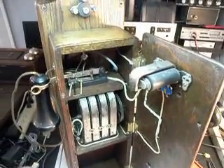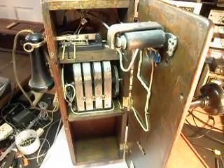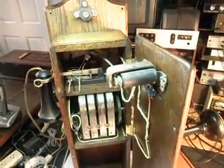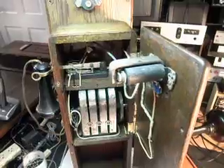They had a request that basically they wanted the telephone to ring, but they also wanted to be able to crank the telephone and have it ring the bells. In the earlier video we showed that if you connect the crank, you have to connect it in a way or have a situation in the circuit that allows the crank to ring the bells but yet breaks it away from the telephone line so that you're not pumping voltage back into the telephone line — because it would ring all your telephones. You don't want that back flux of voltage into the line.